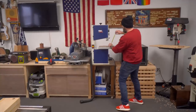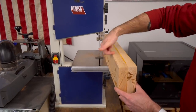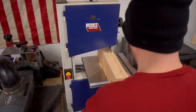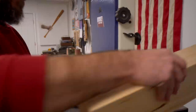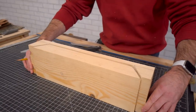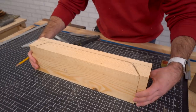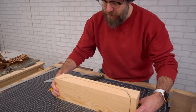I have a limitation on my band saw — when we run this through here, that's all the higher I can go, so I've got to cut this down. Now I'm going to sand off a little bit of the edges on this inside piece, because as I move this top piece up, you can see the lines aren't consistent — this is a little thicker and this is a little bit thinner. The trick is to remove as much material as the thickness of your glue-up, so what I have to do is just sand down a little bit on each edge so there's the same gap.